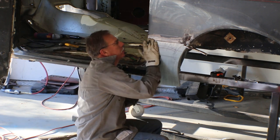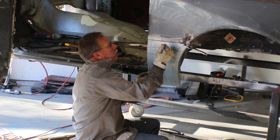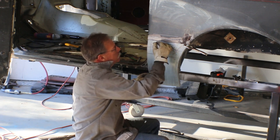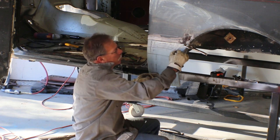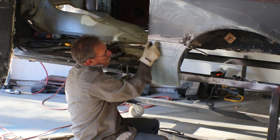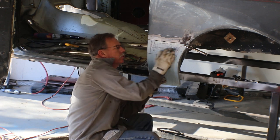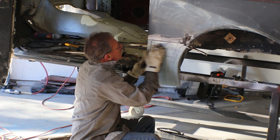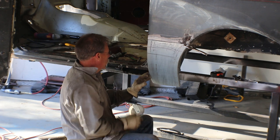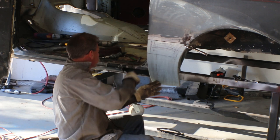You can see we now have, well, you may not be able to see it in there, but we're almost even with the metal here now. I think I'm going to put just a little more curve here, so I'm going to run it through the wheel, probably here and over here mostly, so that I stretch the metal right here and right here in these areas to increase that convex shape. The center is in real good shape, so it's just over here and over here that I want to do a little more work in the wheel. And then I'm going to go ahead and trim this off and we'll see how close we are to getting this to curve under.